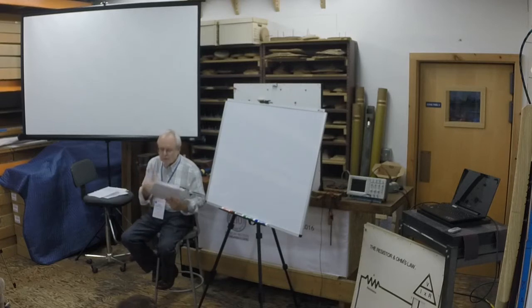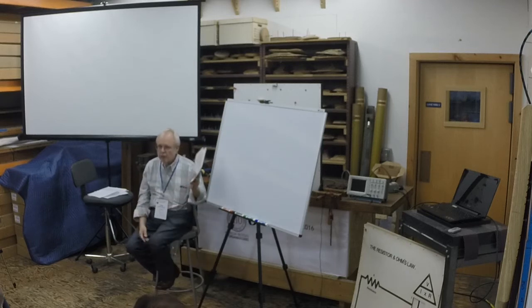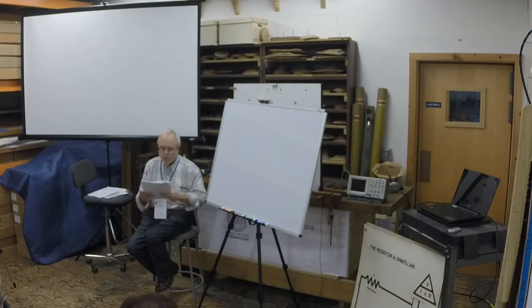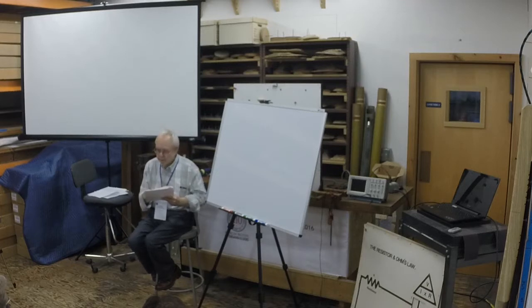Okay, pages 18 and 19 and 20 give some useful reference information on wire gauges and wire sizing. The one on page 19 is a useful little no-brainer chart. You look in the left column, how many amps are going to flow in the circuit. Let's say 15, and it's going to be 25 feet long. So you want to use a minimum of 12 gauge wire for that.